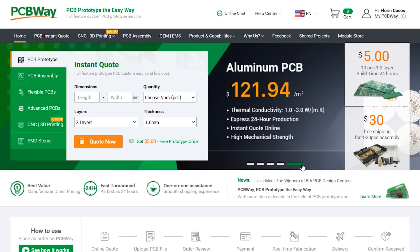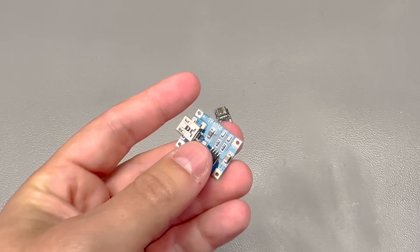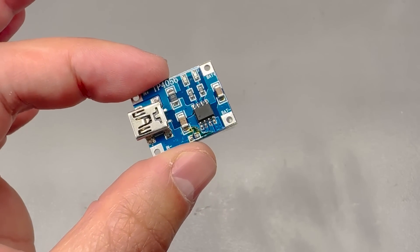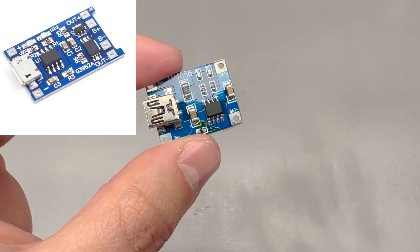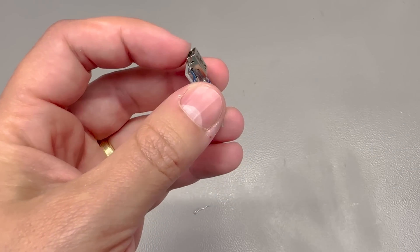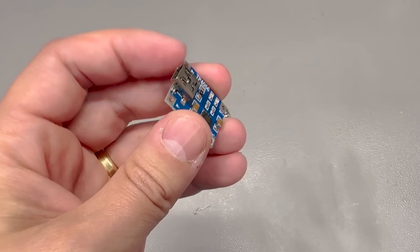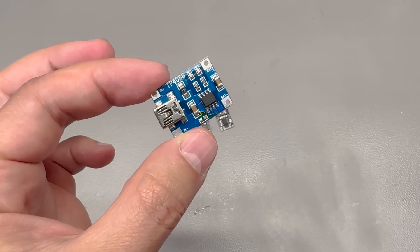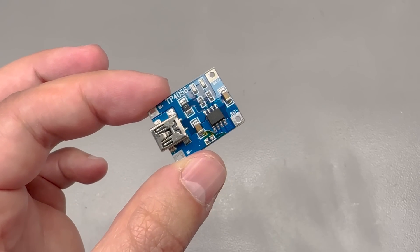Next up I have a couple of charging modules. We all know the famous TP4056 linear charging IC for lithium polymer batteries — it's 5V 1A. Some boards come with a battery protection IC plus MOSFET, some without. They all had mini-USB connectors in their first revisions, then switched to micro-USB, and it's about time we see an upgrade to at least USB Type-C if not a better newer IC.